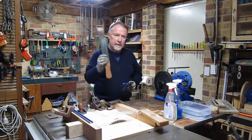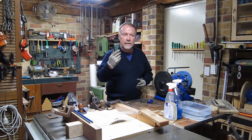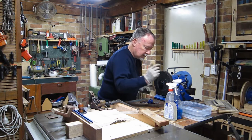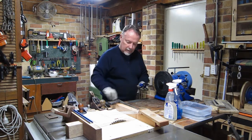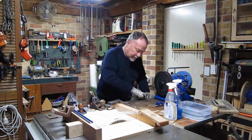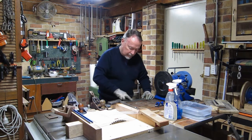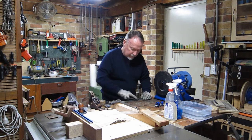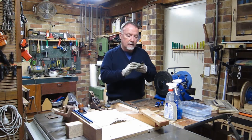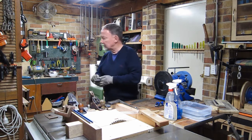The final stage of the process is a leather strop — also from eBay, $7 from China — and green compound, which I think is chromium oxide or something like that. I put a few strokes of that on the strop, remove the plane blade from the honing guide, and give it a few strokes on the leather strop. What I now have is a very thin line across the top which is as shiny as a mirror — you can see yourself in it if it were wide enough. When you've got to that stage, you know you've put a good finish on it.